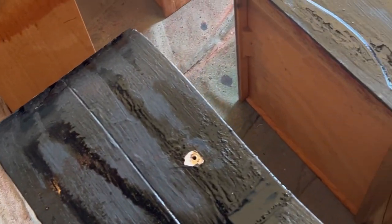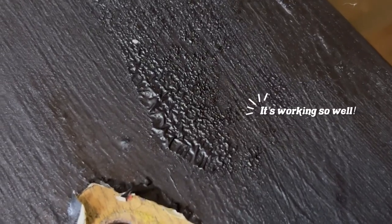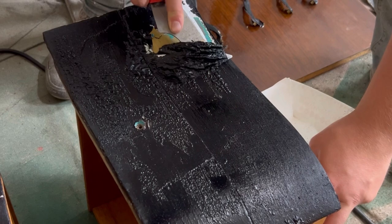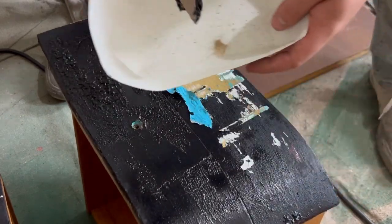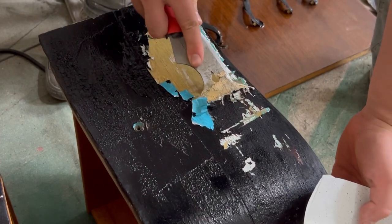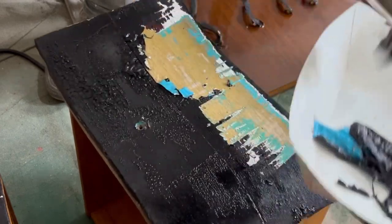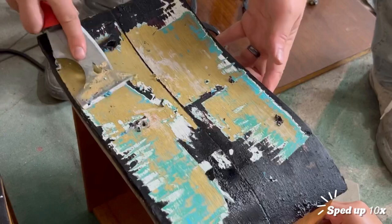The first step in using this stripper is to lightly coat whatever you're working on. As you can see here, the stripper was coming out in more of a stream rather than a mist, which makes it harder to lightly coat the entire surface. In a little bit you'll see us switch over to another bottle to make this process easier. Here's how it looks after the first pass — even though it's not evenly covered, you can already see that paint starting to seize up, which is exactly what you want. We keep coming back to make sure the surface is wet, and in about two hours we start on our first attempt to scrape off that paint.